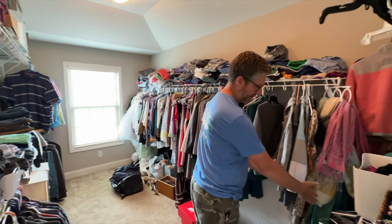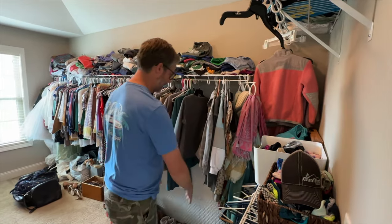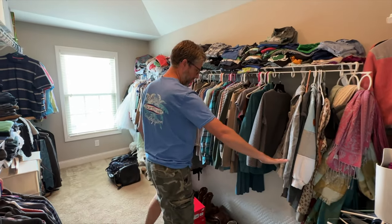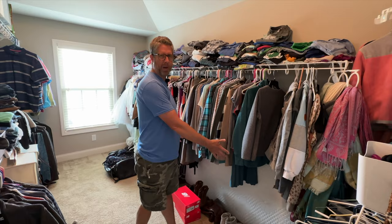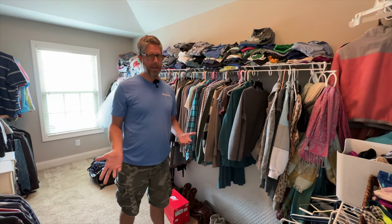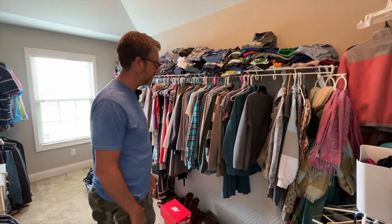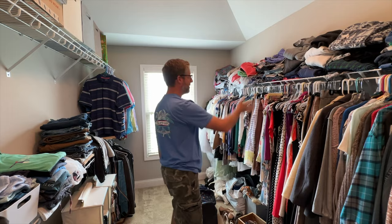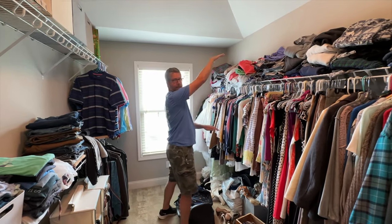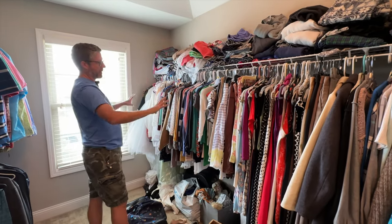Moving on, we need to leave a little bit of room in front of the floating shelves — they'll probably be about 14 inches deep. Starting here going to about here, about four feet, will be a countertop height, and below that will be a double bank of drawers. Another possibility is just buying a dresser that fits that spot. They're a lot cheaper than what you could actually build it for. Then it will go up eight feet and all the way to the end wall, and what we'll have in this space will be a double hanging section — a hanging bar up top and a hanging bar down below, giving us a good almost 70 inches of hanging space.